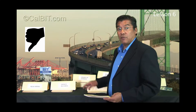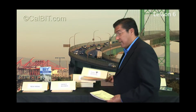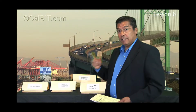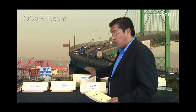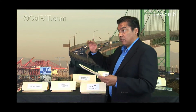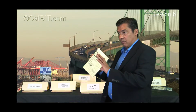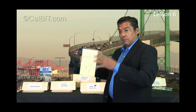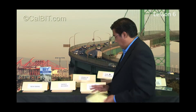It's basically like a maintenance file, which we're going to be discussing more in step number 8. But very basic, just make your own file. Again, don't commingle thumbs up with thumbs down. Something I didn't mention in the step 5 video is that a lot of times the DVIR is with the logbooks if you have to run logbooks, so it's part of the logbook. Don't do that either. Don't commingle. Get separate reports. Logbooks should be logbooks, DVIRs should be DVIRs. It's much simpler to administer and to keep track of.